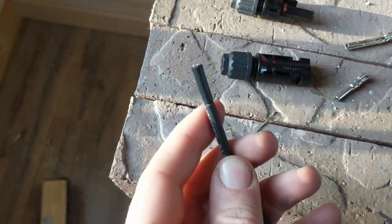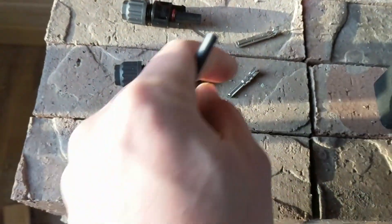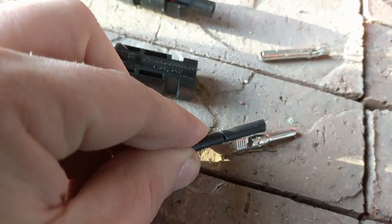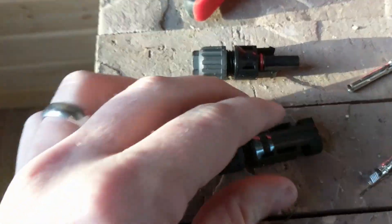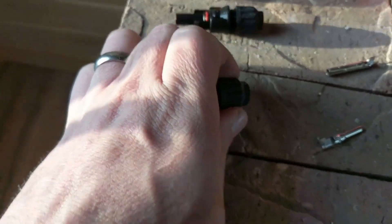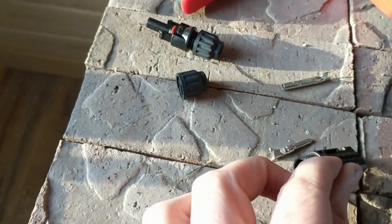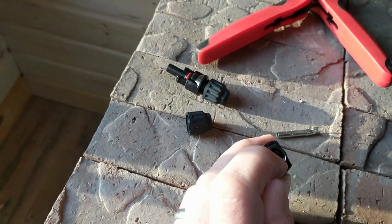I just stripped this — it's number 10 wire, so I've kind of already scored it. We'll strip this and the wire just goes right in on there. Once it's stripped, it gets crimped on. And then this unthreads — so this will unthread there, and once it's crimped, this part goes right in here and you'll be able to see that stinger right inside.